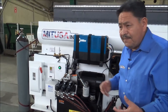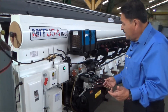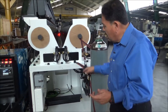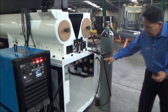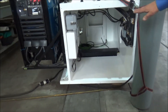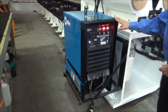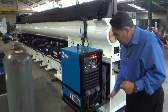The mandrel is plumbed with the welding gas necessary to keep the weld nice and clean, and all of that is automatically turned on when the weld starts — or a few seconds prior. Here are our AC lines, step-down transformers, slave regulators, and air regulators. Inside we have all of our airlines and interconnections for the lower voltage electronics. You can see how clean all of this is. In this particular case the customer wanted a Miller Auto Continuum, and you can see how clean we are underneath as well.